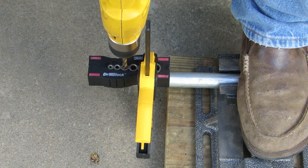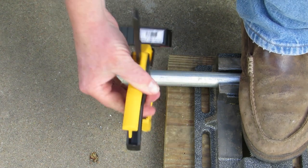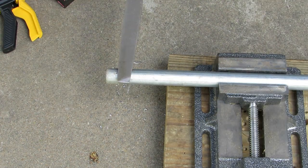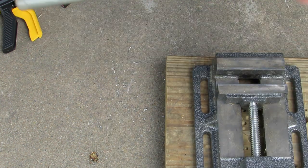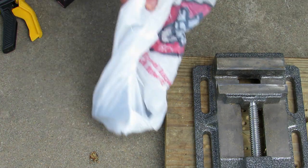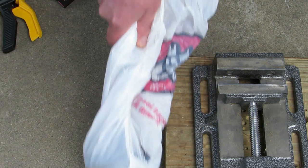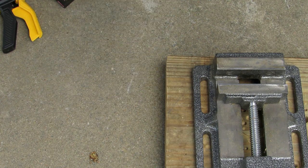Remember to drill at a low speed when drilling through metal. Once you have drilled through the conduit, remove the clamp and drill guide. Remove any metal burrs around the hole by filing them off of each side. Tip the conduit downward and tap out any metal shards that are inside. To finish, place a plastic bag over the magnet and pick up the metal shards. The bag along with the shards can be removed from the magnet and thrown away.